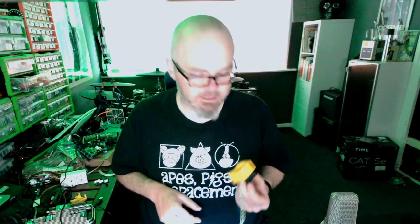It was basically being pumped 24 volts and getting hotter and hotter and hotter until it started to smoke. It absolutely reeked in there — I had to open all the windows after I turned the thing off, luckily before anything actually caught fire. The hot end is now no longer two pieces; it's one solid fused piece — it got so hot that even with all the screws out I can't get it apart. The heat break inside, I managed to have the mother of all clogs. As I tried to unclog it, I bent it. So I had to order a spare from Triangle Labs, which I fitted in there. Thankfully they're still selling spares even though they can't sell the whole kit — maybe get yourself some spares.